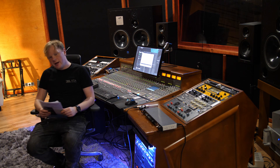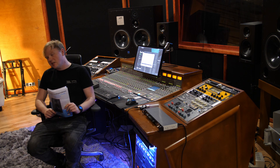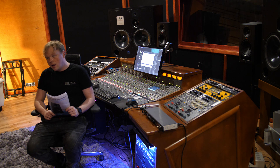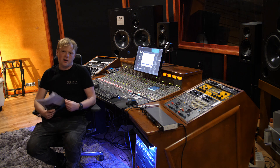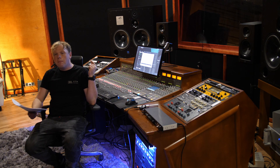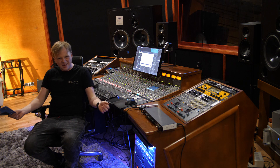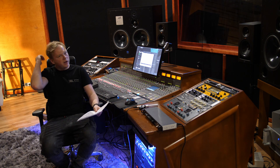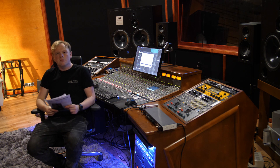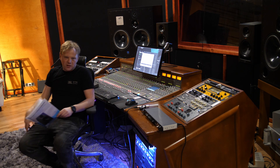Okay, we're done with the measurements. Check out the link in the description for the results. About the self-noise: I admit it was also my complaint about the LP8 model that in the near field the self-noise was actually a problem. We measured the background noise of this room — which is, by the way, quite impressive — at 33.1 dBA. This is an awesome noise rating for a control room, especially considering this was measured with a PC running. Next, we measured the same background noise with the IN8s on. The difference was negligible — one-tenth of a decibel, below the threshold of measurement error. Using IN8s as a midfield monitor and measuring at the sweet spot revealed that the self-noise of these speakers is too low to be even noticed. Please note that this applies only to midfield applications. What about near field? Check out the second part of this video.